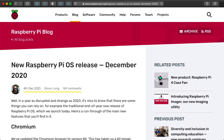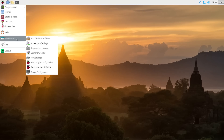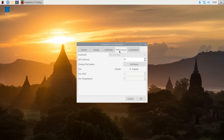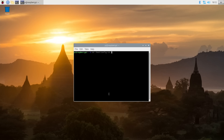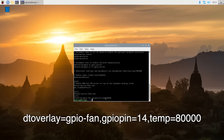To support the fan hardware, a new Pi OS update released on December 2nd made it easy to configure options for the fan, like which GPIO port the blue wire is plugged into, or what temperature the Pi CPU should reach before the fan powers up. I enabled the fan in the Pi configuration utility and left the defaults, which are pin 14 and 80 degrees Celsius. If you want to configure the fan settings in the boot config.txt file, the settings are here under the GPIO fan DT overlay.